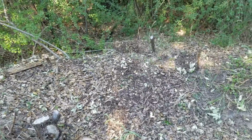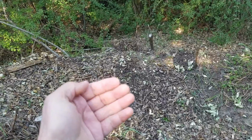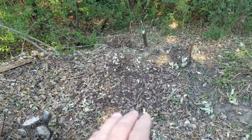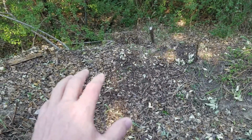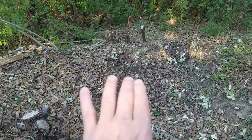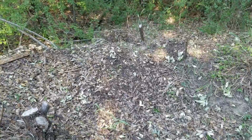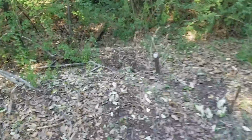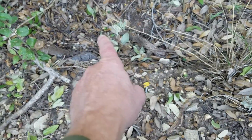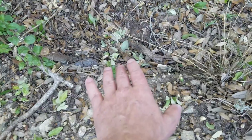The other downside to using debris is, in addition to shrinking, sometimes it'll break down inside the soil. So you have a solid soil surface here and on top and on the other side, but because there's a giant log in there that may have broken down, the water starts to seep through the soil. It gets in there and it'll start to create like a cave, and then it can flow out the other side. And in that way, it can create like a hole in your dam. And that's exactly what I had happen right there. The water started to just ooze out right there at the very bottom of the topmost part of the dam, the top about 1.5 feet of the dam.